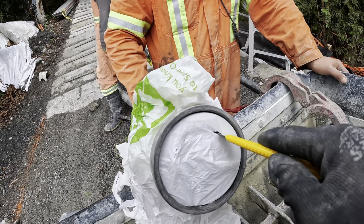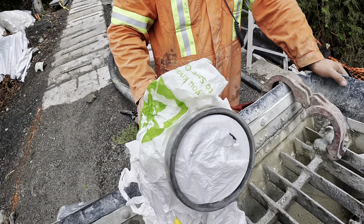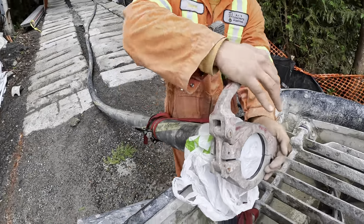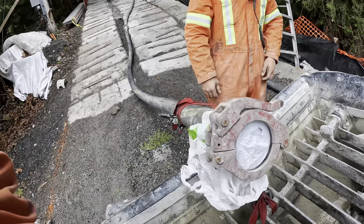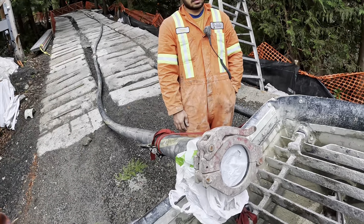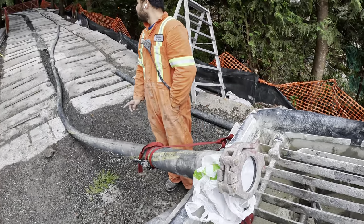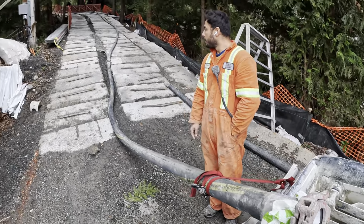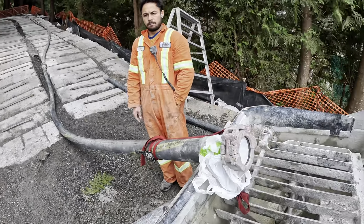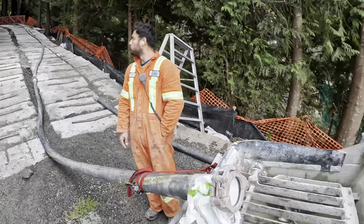Two little eyes. Two little sad eyes. And we'll videotape when we prime through here exactly the effectiveness or lack thereof of the plastic bag. I have a feeling with the two eyes there, the breather ports, I think this is going to work pretty good. Like I said, it's shotcrete. I'm 100% confident we could have primed this through without the bags. Regular mix might have been a different story, but anyhow, we'll get the action shots here. It'll be a good discussion point, shall we say.